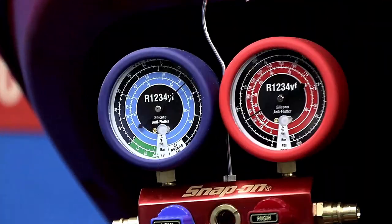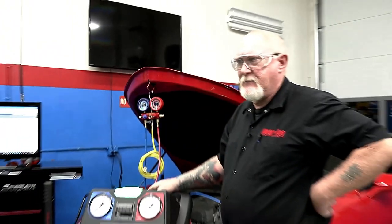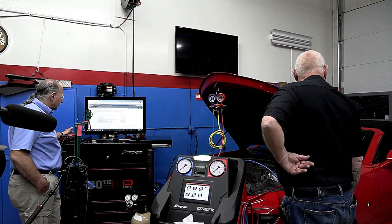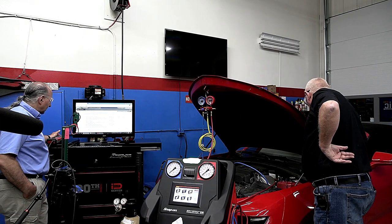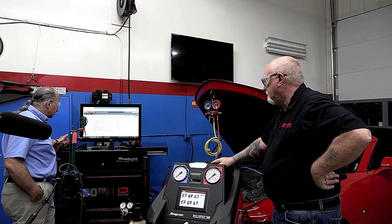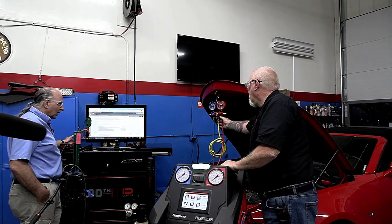The Camaro — Chevy gives us three different steps. The first helps us determine if we have enough refrigerant in the system to continue the test. Steps one through three: park the vehicle inside or in the shade, open the windows to ventilate the interior, check that the AC system was operating, allow the AC system to equalize for two minutes, turn ignition off, install the AC service fittings, record ambient air temperature and humidity, and record low and high side static pressure readings.